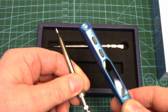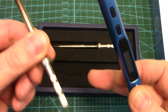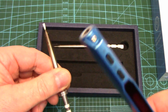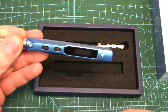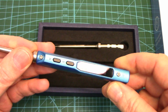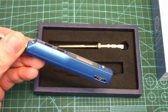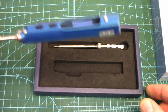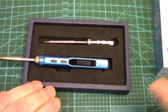And of course the primary reason for that is they use the cartridge style direct drive tip technology, tips, sensor and heating element built right into the tip, giving incredibly fast response and efficiency, and it's controlled by an STM32-bit processor with all kinds of neat little features. It even supports open source if you want to change things around. And of course the price is phenomenal. It comes with the base and one tip for around $60 US.